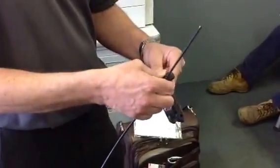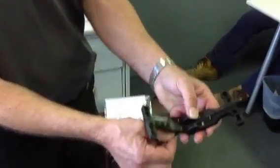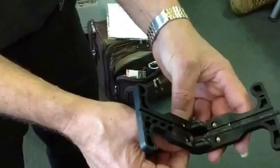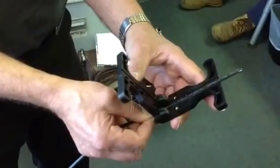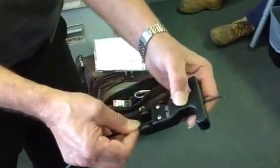Next operation: you grab the cable, lay it on its flat side into the tool, and lay it into slot number 2. This part of the stripping process — you don't need to strip very much. We recommend normally about 8 centimeters. You can do a little bit more or a little bit less, whichever is easier for you. Then just close the tool up again and pull it.